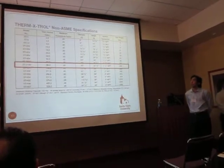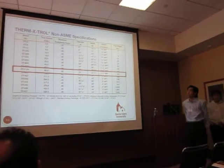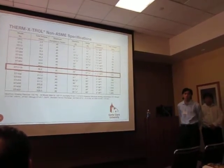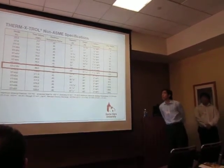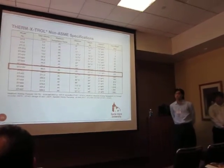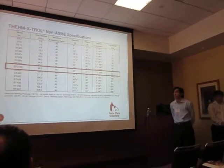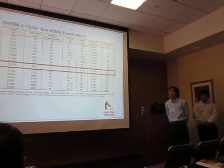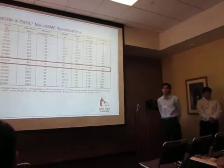And this is the model of pressure tanks that we decided to go with. It's the Amtrol ST210B. As you can see there, they hold 86 gallons, and we decided to go with 4 of these tanks to meet the customer need of 300 stored gallons. And we also decided to go with 4 smaller tanks instead of 1 large tank for ease of installation as well as shipping, and for redundancy. If 1 tank should fail, or up to 3 tanks should fail, this system will still be able to run just with less stored water.